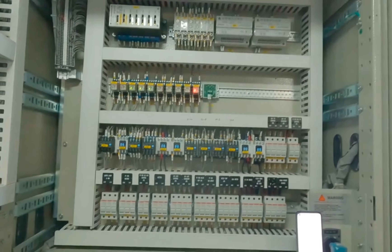In 40 seconds the emergency generator came on load. We will run this emergency generator for a minimum of 1 hour and slowly increase the load. This is the emergency generator breaker — you can see the emergency generator breaker is in closed position. And this is the main switchboard bus tie which is already in open condition.